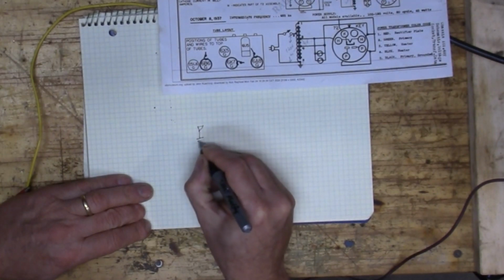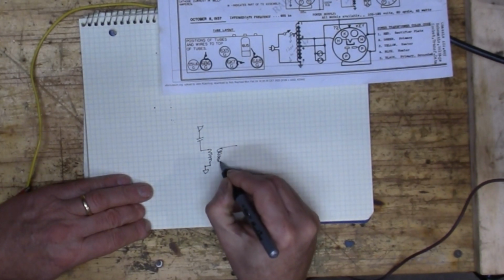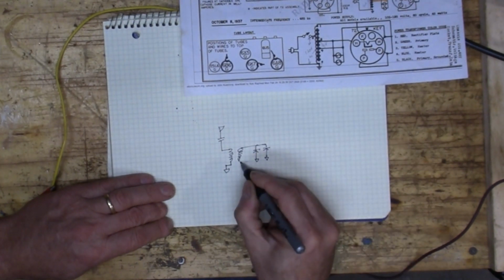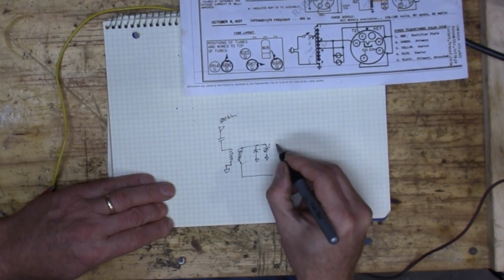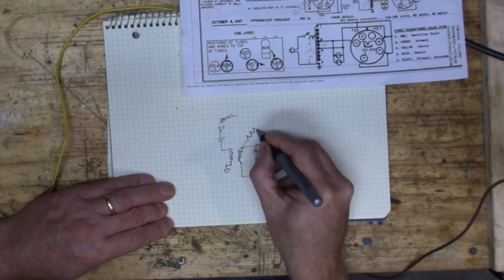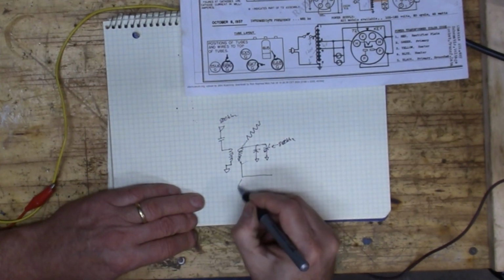If you look at this circuit, you've got your antenna, it comes in, a little capacitor, and then comes into a transformer winding, and then another transformer, or actually it's a filter, and then a variable capacitor here. And that's acting as a filter for the signal coming in, right? That's the variable one right here. So if I put in 800 kilohertz, and then I tune right here to 800 kilohertz, I get a nice signal coming through here, and that signal is properly attenuated as I tune in and out. But I'm getting nothing here, right?